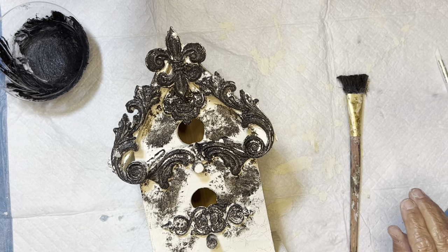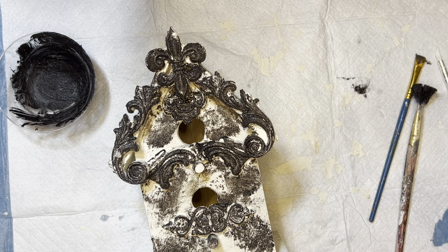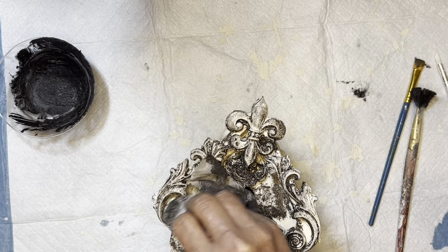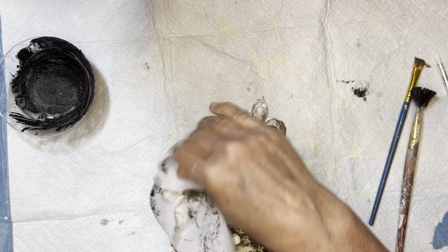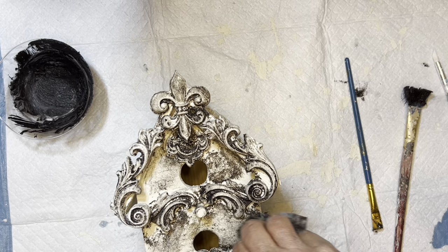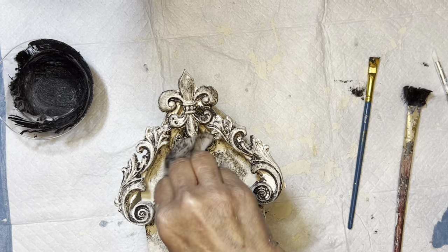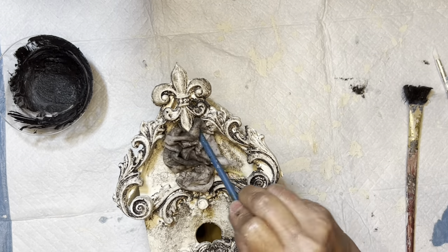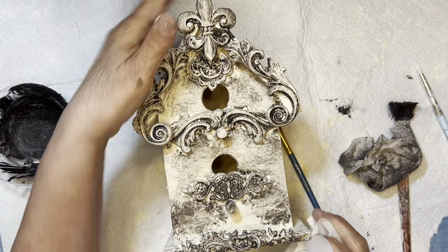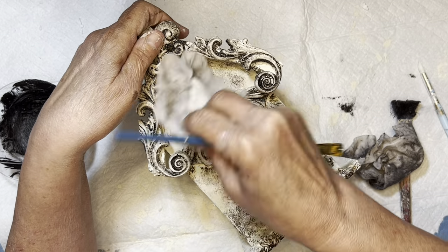I did not put a clear coat on this beforehand, so it's going to absorb quite a bit of the wax. I'm wanting this to really look kind of grungy. I wipe off a lot pretty much as soon as I put it on — otherwise it would be super dark, and it still turns out pretty dark. I want a big contrast between white and black, so I figured I'd do that rather than use a brown. Once I put the black wax all over, on the wood pieces where I did the crackle you can see the cracks really well, and some chippiness in the paint really shows up.